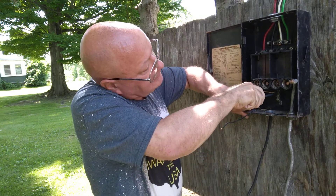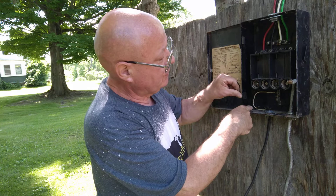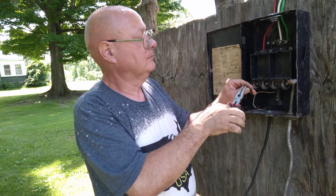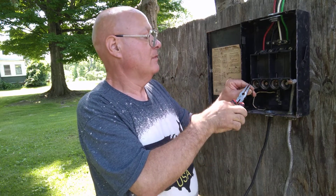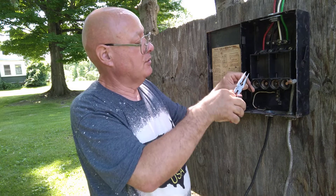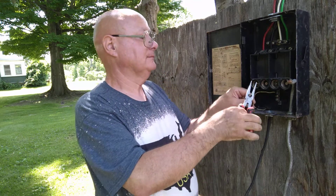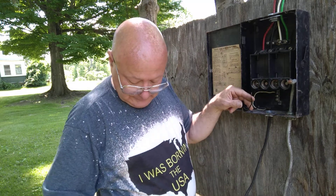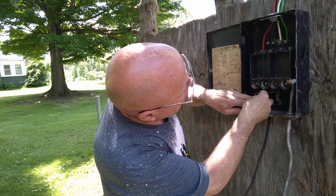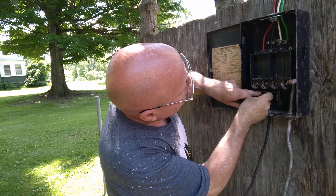That screw was tight. Now we'll put our black wire over here on the fuse. I heard that screw open just enough to get the white wire under the head and tighten down — I only had to turn it slightly to get it tight. This one just tucks under the screw head, or I could get it under the side over here on this side.